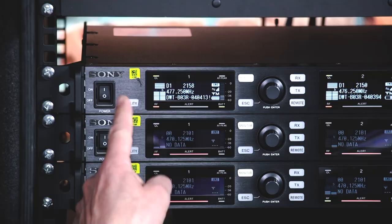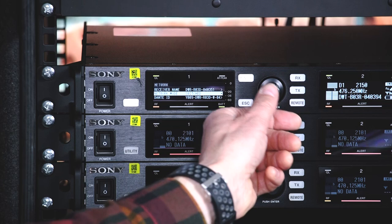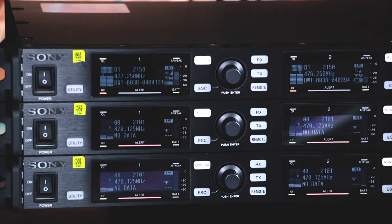It's a similar setup with the Sony DWR-R03D. Press Utility, open the Network menu and set the Network mode to either Switched or Redundant. Remember that device control doesn't work through the secondary network but only through the primary. Scroll to Dante ID and set the mode to Yamaha ID, choosing a unique number for each unit — though the number can be the same as an ID used for a console or RIO unit, it must be unique among devices of the same kind. Find the receiver IP settings in the Network menu and set the IP mode to Auto. Do the same for the Dante main IP. Only use static IP addresses if you really know what you're doing. Reboot the device if you are asked to.